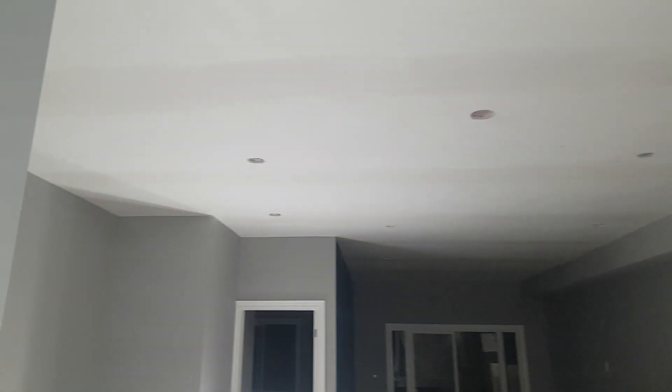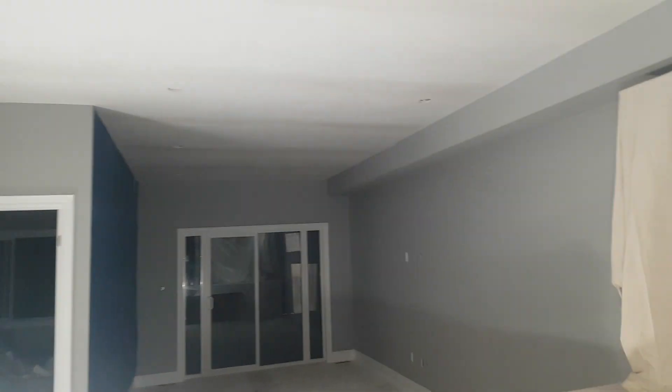There's literally just this section here left, and to me this is one sheet — there's no touch-ups on one sheet of drywall. The butt joint is right here, so there's no sense in sanding that whole sheet. Look at all the detail work around this area; there's an off angle, so let's make it easy to spray and just leave it at the flat stuff.